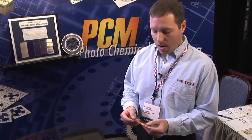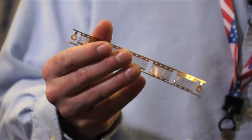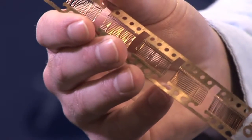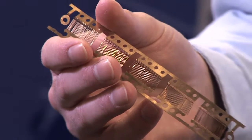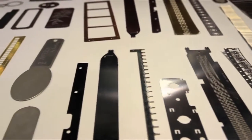We do anything from doing just a flat pattern to actually a formed part — something that can be plated as well as formed. These are secondary operations: we'll etch your part out first in the flat pattern, then we'll work on forming it and plating it for you. If you have any questions about photochemical machining, give me a call and we can help you out.